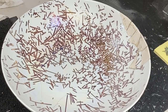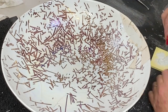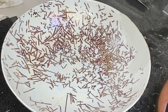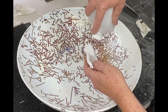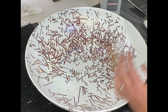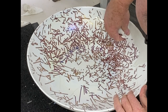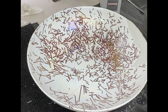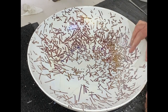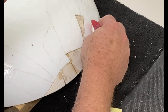This is PC-11, a two-part epoxy filler — a 50/50 mix. I'm filling up the gap using that same silicone rib, the red rib, to smooth the surface. I'm using alcohol to clear off any PC epoxy that went to areas where I don't want it — you do this while the PC epoxy is still malleable and soft.